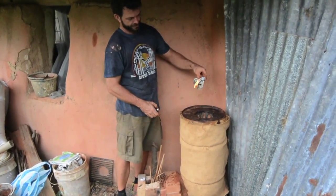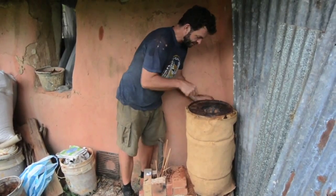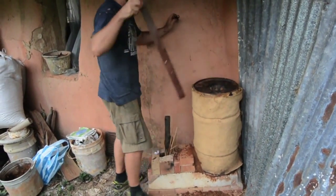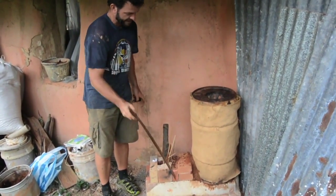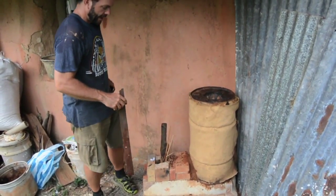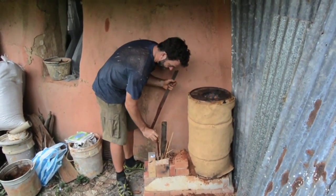So we're on to ignition here. I'm just taking a paper ball — we filled the fire tube full of crumpled newspaper. I like to light it from this side because it creates the draft immediately. This way it builds back pressure. As this side heats up, the fire will burn in this direction. So by the time the fire gets here, the entire tube has been preheated, and that creates an instant draw — a very dramatic draw. The higher our draw, the hotter our heat.